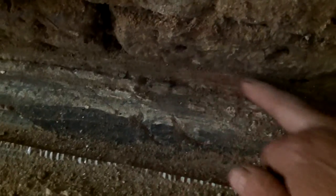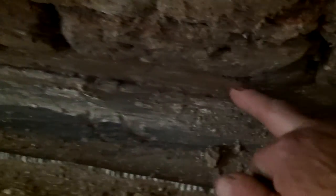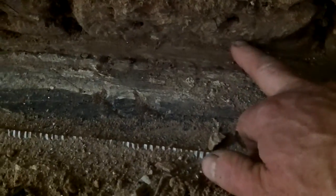What we need to do is probably just take out — somebody's actually filled in a gap here — we need to take this gap out and open it, so we disconnect the slab from the wall. We have a little air gap here that allows moisture to get out, and at that point the wall will stay dry.